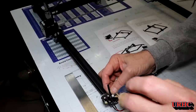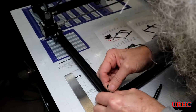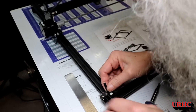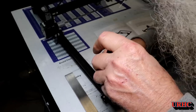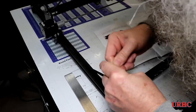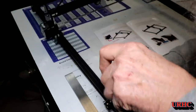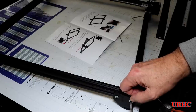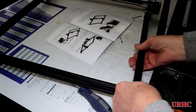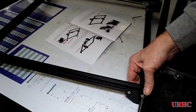There's a D-shaped hole that the belt pulls through to hold it on that side. A screw goes down through there and captures the belt while also holding the switch in place. One thing I found out: once you start that screw you can't move the belt again — I had to pull the screw out to take a little more slack out. I got the switch located near the end where the manual shows it, then went back to the other side where it's easier to tension, and gave it a good yank to finalize the drive system.